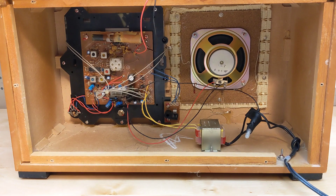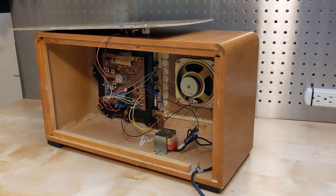It has component designation silkscreen but no solder mask. The build quality is a little sloppy — I see some poor soldering, the flux residue is not cleaned off, and some wires are longer than needed. The FM antenna wire around the line cord is held crudely in place with some electrical tape. The manual says the case is handmade, which was no doubt the highest cost component. The wooden case is made of medium density fiberboard, or MDF, an engineered wood-based sheet material with consistent properties that can be machined. The original radio is likely solid wood and/or plywood.